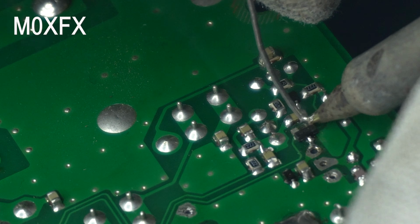Looks all right from my house. We've replaced the transistor and we've basically got everything set up as we had before. We're basically emulating the power as it would be if the radio was running. So what we've got here is our 13.8 volt rail. We've got a TX8, which we can switch in on the power supply. And we've also got the negative coming up to the ground on the radio.